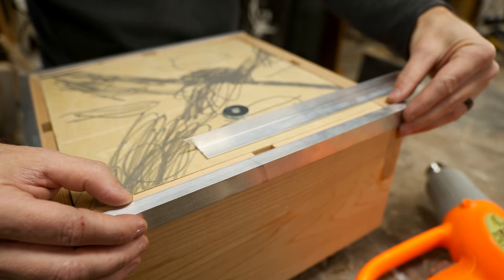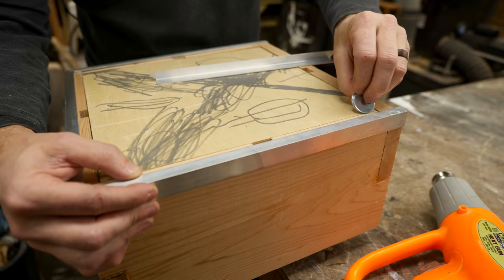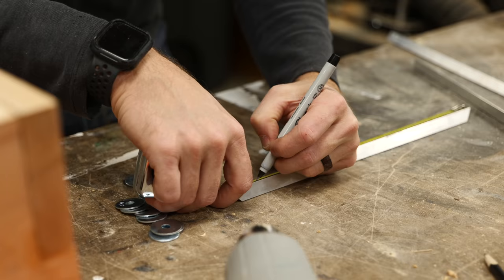I've got this upside down so that I can put these rails on the side. They need to be lifted up so that the rails that are on the top of our little slide can actually fit in here. So before I screw them on, I'm going to put some washers underneath them, and that'll give us the offset that we need. Then we'll pre-drill and drive in some screws from the outside to lock these in place.